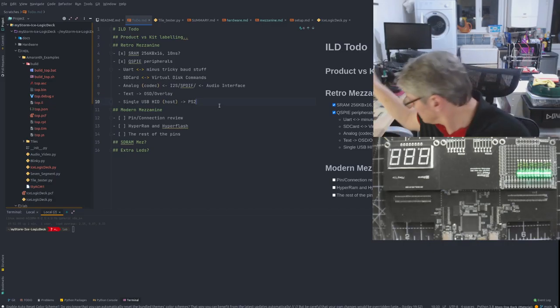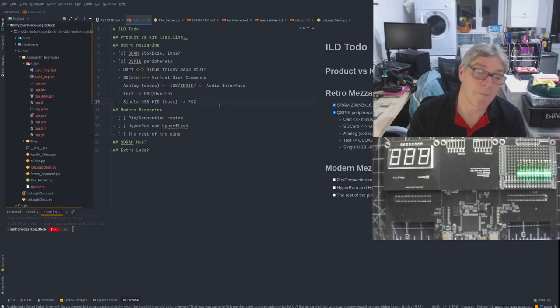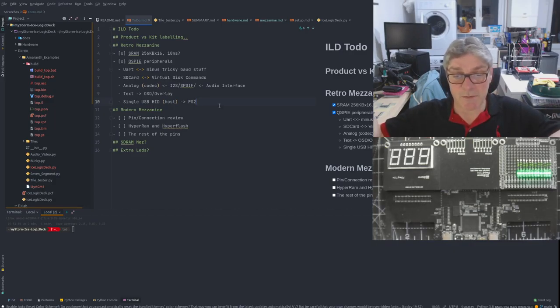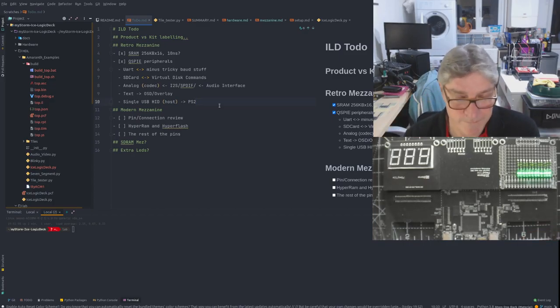Because each tile has 12 IOs, or up to 12 IOs. For the camera, you need 8 data bits, and you need the syncs, and you need the pixel clock, and you also need a clock for driving the sensor. So that uses up the 12 FPGA pins. The I2C comes from the STM32, because that I2C is routed to all the tiles. In fact, there's two I2Cs routed to different tiles. That reduces the chance of address conflicts.